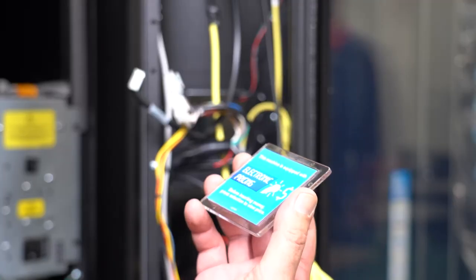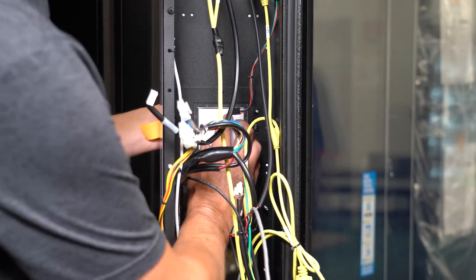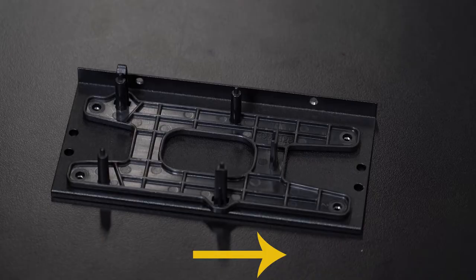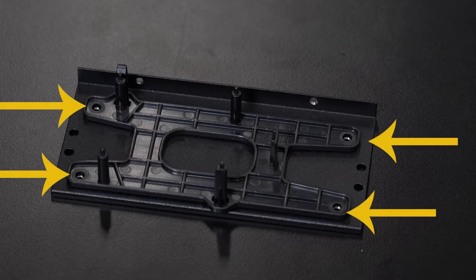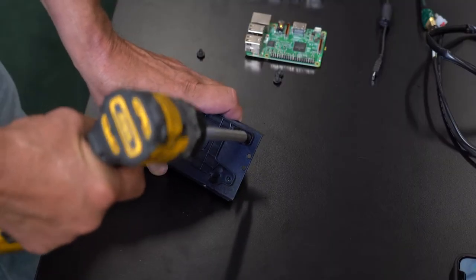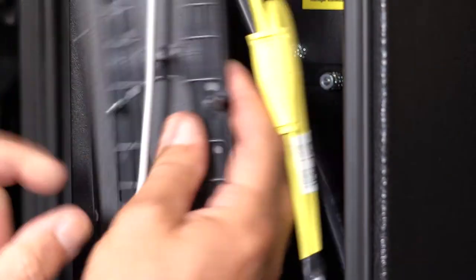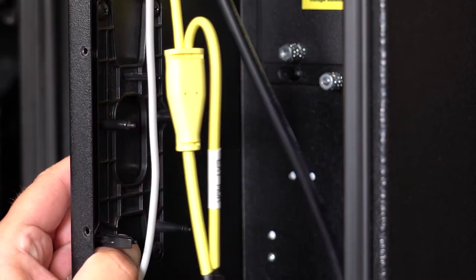Apply this label to the bezel window here and place some masking tape in the front to hold it in place. Make sure the SBC Raspberry Pi mounting bracket is facing this way, then use the four screws to secure these parts together. Place the SBC Raspberry Pi mount in place on the side of the door here and use the two screws to secure it in place.